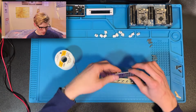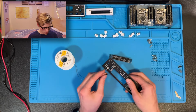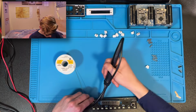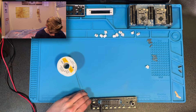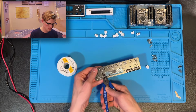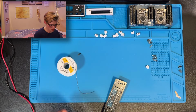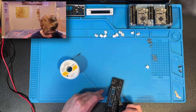Our last step is this circuit board right here. What I'll do is use the long end of the pin headers, put that through, put the 7-segment display through, and then solder this on. Now what you can do is you can come in with your side snips and then just lift this plastic part off. That'll expose the bare pins, and then you can get soldering. Just make sure all the holes roughly line up.